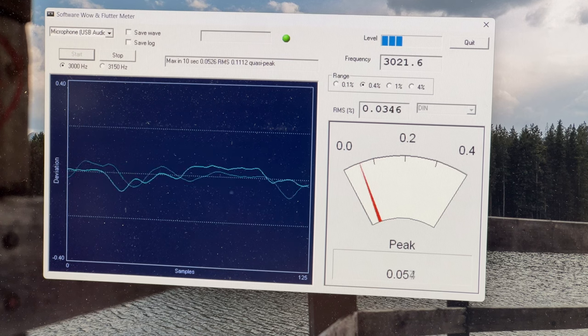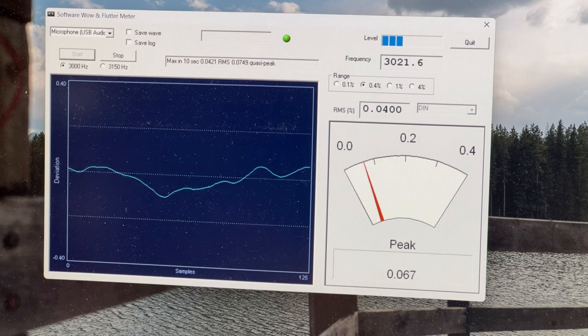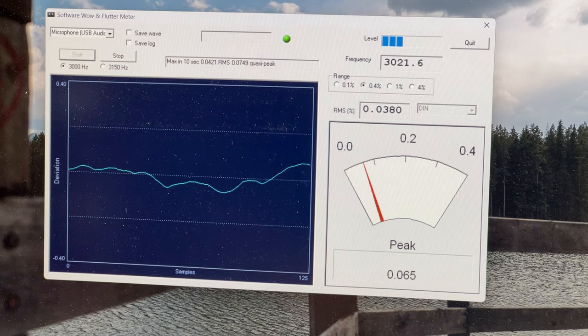Oh yeah, it's happy with this one, and I'm happy with this one. Already saw 0.0302. It's going to resonate up and down like the other tape did. Give me the 0.029% you gave me before. I know you can do it. That's okay. It doesn't have to do it. These tapes are not intended actually for wow and flutter testing. They're intended for speed calibration. You need specialized hardware and specialized equipment in order to do tapes like that. And I will just never have access to those.